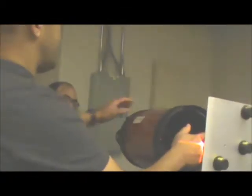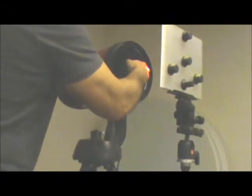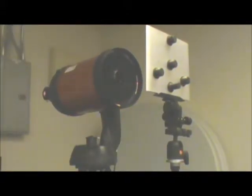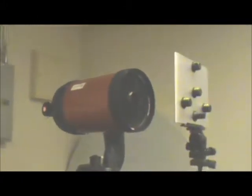Let me take this out and see what it looks like. Some scopes, for example the Celestron EdgeHD, have built-in corrector plate adjustments, a very good feature. In other scopes, we will hold and shift the secondary mirror to adjust until the four inner crosshair tips are symmetric on the same concentric ring. Here is where we would do the minute adjustments on your scope to get that crosshair straight up where it needs to be, but we can't. That'd be a Celestron send-off thing to do. But the bad part is, by the time UPS gets it back to you, you'd probably end up the same way.